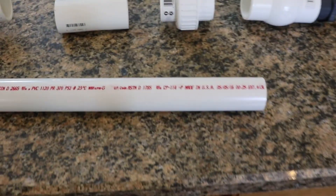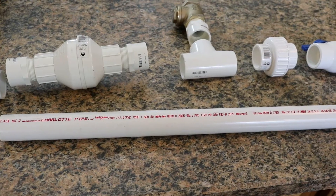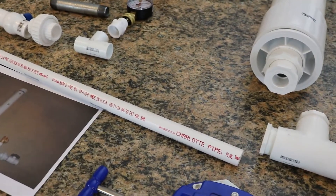So I'm going to cut down this one and a quarter inch pipe and then this three quarter inch pipe. I will put these pieces together with the glue, and if all goes well, we should have a ram pump working. I'll test this out in the backyard here in a little bit to make sure it works.